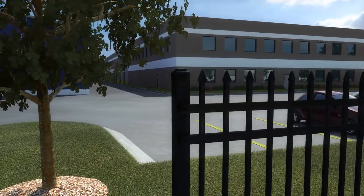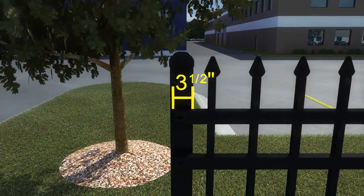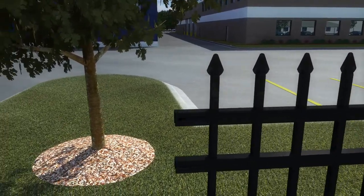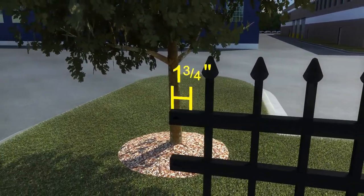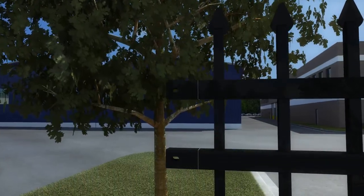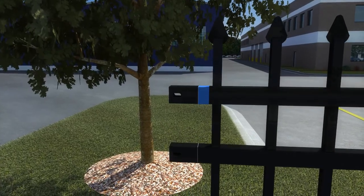Allowing 1/4 inch for brackets on each side, the panel will need to be trimmed 3 1/2 inches. For aesthetics, the panel will need to be trimmed equally on each side, 1 3/4 inches. Score this dimension on each end of the rail. Mark your cut with masking tape to prevent any unnecessary scuffing.